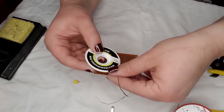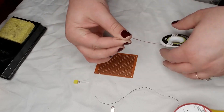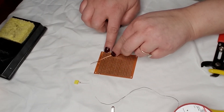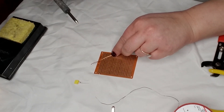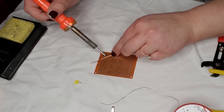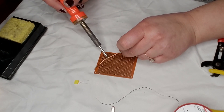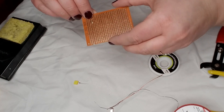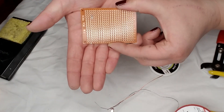So how do we do that? We take some desoldering wick, place it on top of the solder that needs to be removed, then place your soldering pen down and give it a gentle nudge until you see the desoldering wick absorbing it. And then you can see that top pad is indeed a hole again.